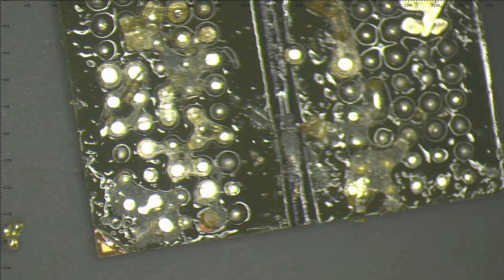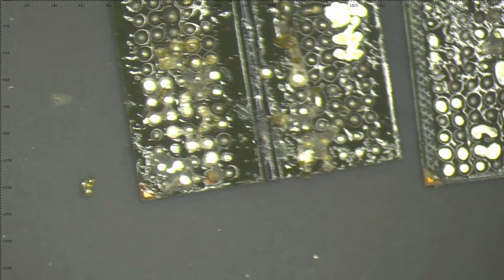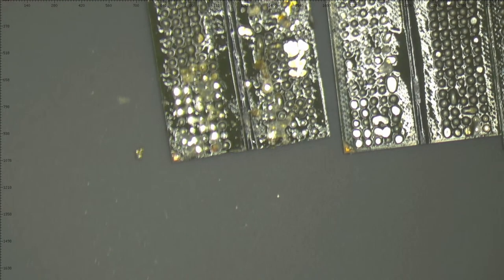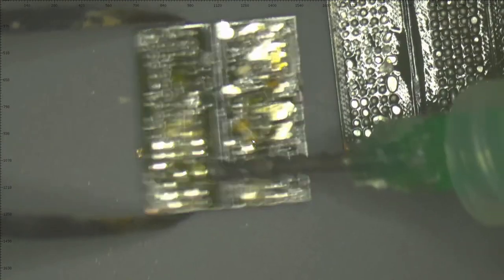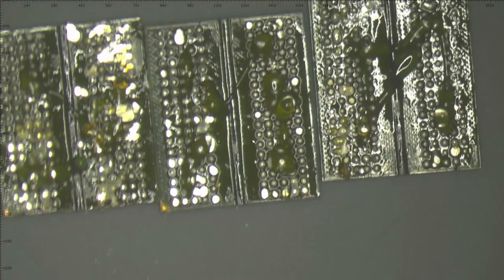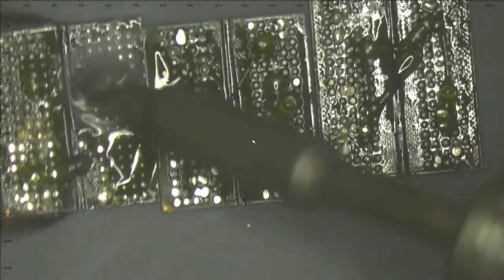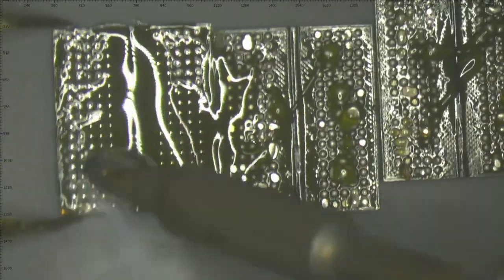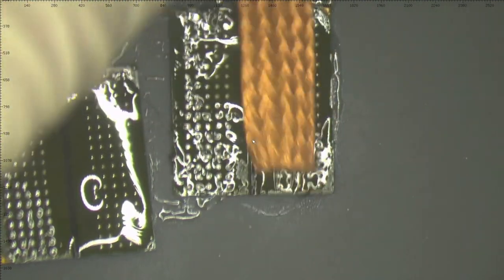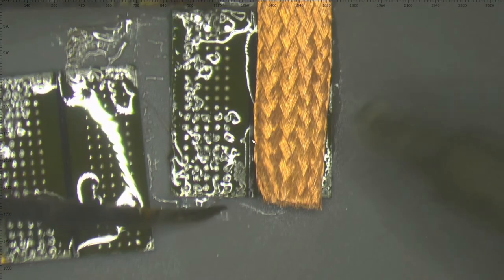Alright, enough talking. Let's clean these RAM chips. I will start with this one first. Adjust the picture for you so you can see better. Applying some flux to all of them. Maybe we can save these two RAM chips because they are not touched. So let's start cleaning. Oh, there are more pads ripped on this one. Hopefully the board is in good condition, because this will be a big mess if the pads are ripped. And all this job was done by a warranty service. Unbelievable.